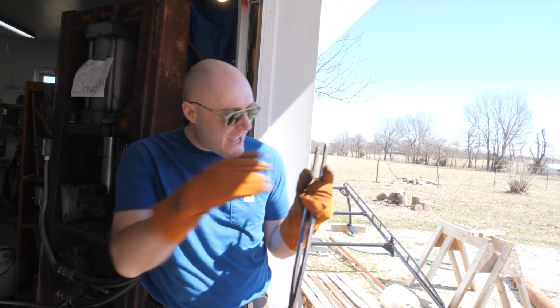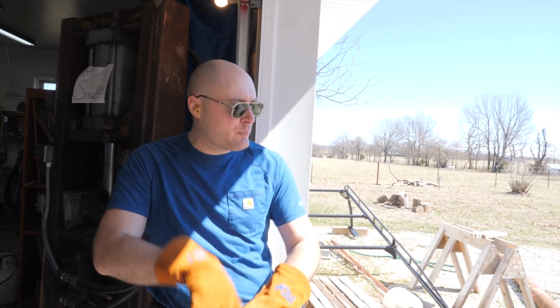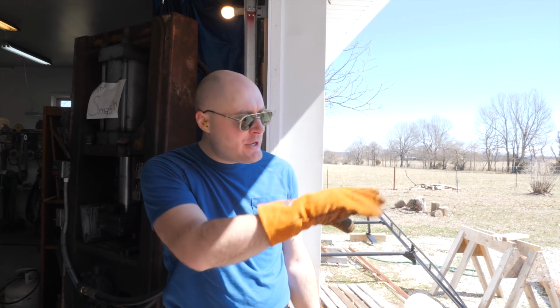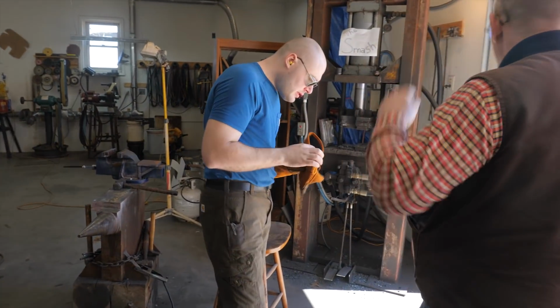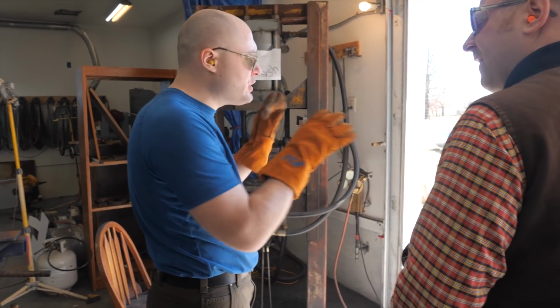The worst part about doing a twist pattern is you can get that edge to tear apart a little bit sometimes from the extreme forging and all that pressure it was under twisting. It's getting real wide though. Yeah, it is. I might gently hit it the other way just to flatten out those little ridges and help the tearing not be so bad maybe. The edges are down a little bit now. Then grind out some of the torn out spots and continue forging this out flatter.